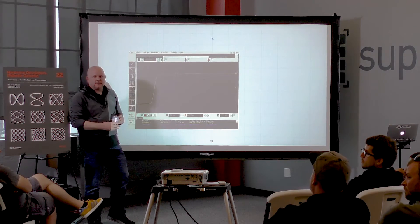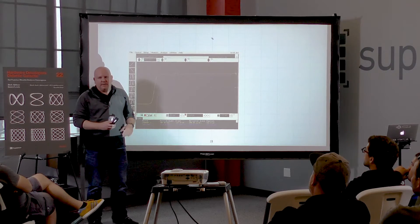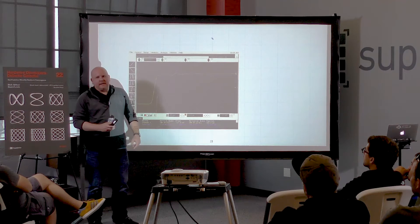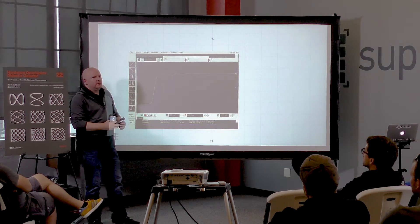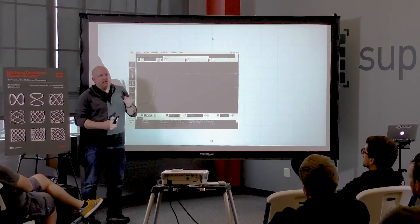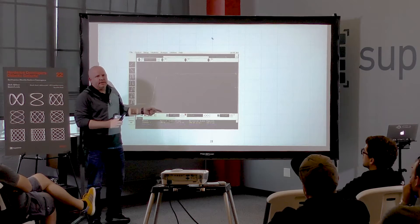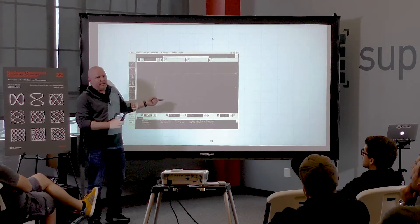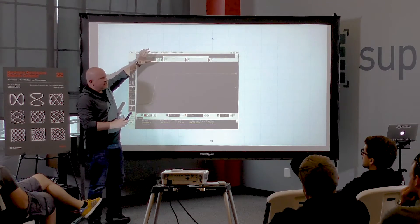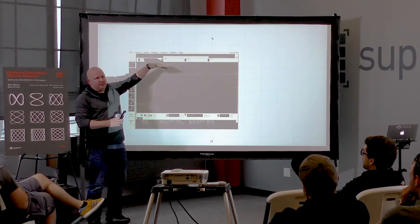Q: Is it expensive or difficult to add AC coupling? When we built that scope, it was one of the first 10+ gigahertz scopes, and at the time it would have taken another two years to add it. Some scope vendors use 8 grids, some use 10 — both sides claim they're better. What both sides are trying to get to is headroom above and below the visible area. Tektronix scopes tend to have a little more headroom so they can handle overdrive better because their dynamic range extends a bit farther than what you see on screen.